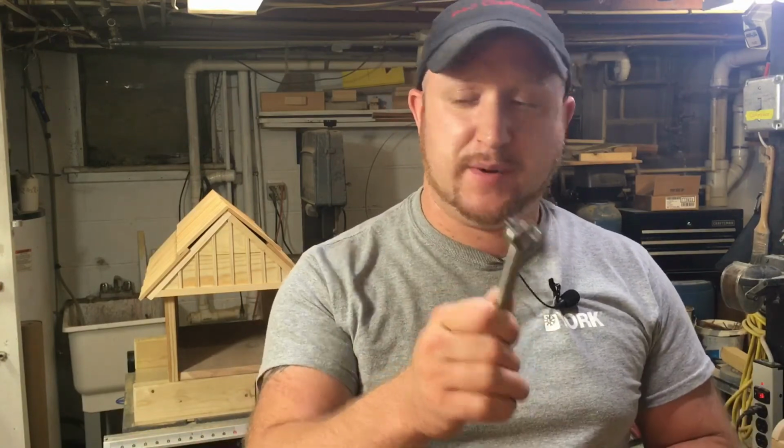If you're making holes for wires through studs, this is perfect for you. But if you are going to do woodworking and you're making a hole in a board that is going to be exposed and visible to many people, you want both sides to be nice and clean. Use a Forstner bit and also put a backing board. So the tip for today is make sure you put a backing board if you're drilling a hole through a piece of wood.